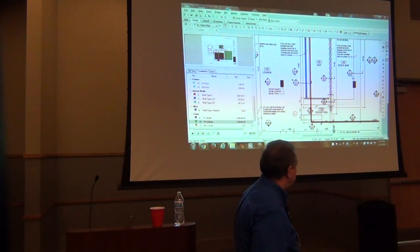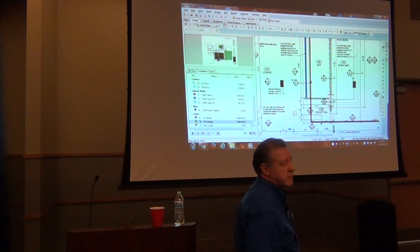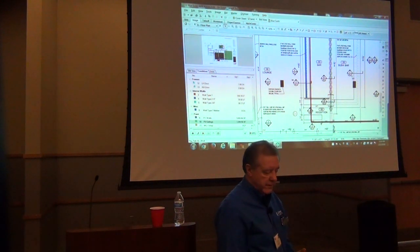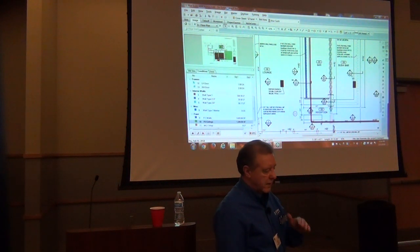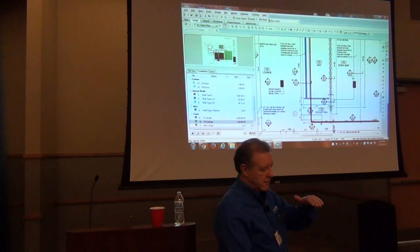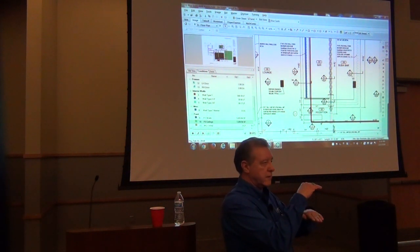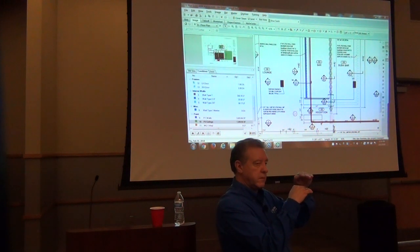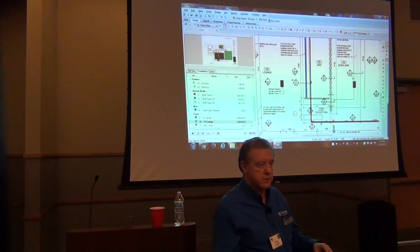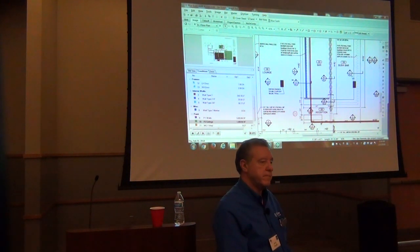Good time saver. I don't know if I have anyone in here that does any type of site utilities, do I? Good. I'm laying pipe. I got to excavate the ditch. I got to put in a sand bed. I put in the pipe. I do select fill. Then I compact and do another layer of compacted fill, and then maybe a topping of asphalt or concrete. That's 5 to 6 objects. Once I create those individually, I can hold down the Control and do 1 line, 6 containers, 6 quantities. And that kind of adds. That's really getting the full effect.